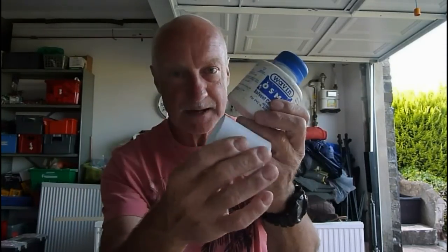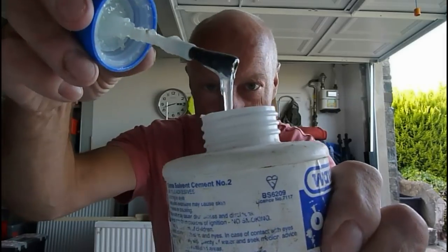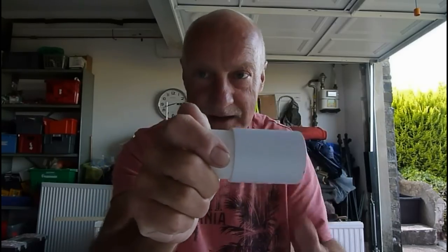There's one very important one that I forgot to add in, so I'm cutting it in now — slicing it into the video. The plastic pipe one: Osma solvent cement, solvent weld — it's the stuff you need to join plastic pipes together. Before you push them in, you use this stuff on it. It's a lovely drop of gooey stuff — put it right round the pipe and right round the inside of the fitting, and when you stick those two fittings together that will hold. You won't be able to move it after about 10 seconds — it will be solid. That's the other stuff that's highly recommended and that I've used for the last 45 years — brilliant stuff.